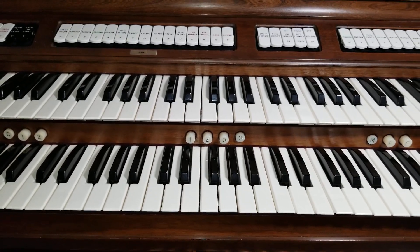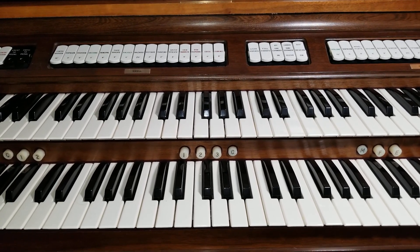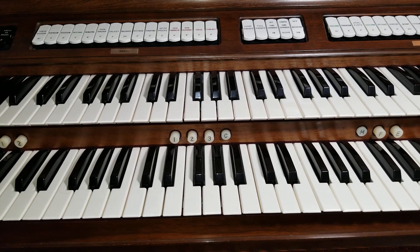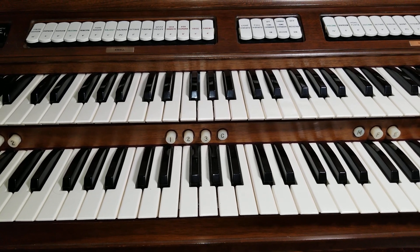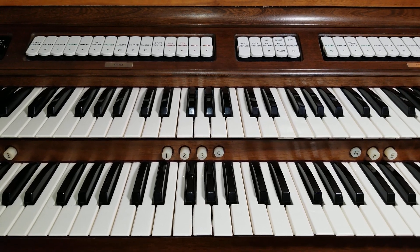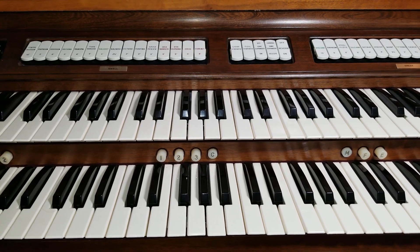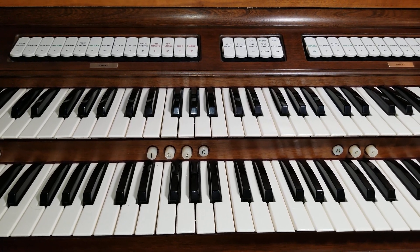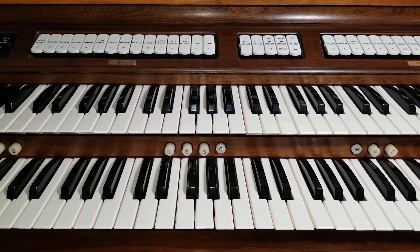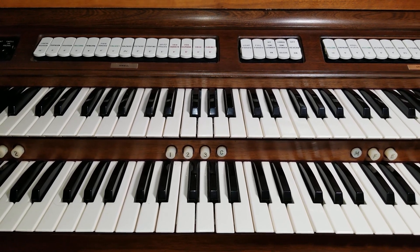One look at the back of this instrument scares a lot of people away. Each key actually has multiple switch contacts, because they're arranged by pitch, and they're not even direct switches — they use an elastomer technology, which I will be changing, because that won't work for MIDI. So it's quite an ordeal, but I am looking forward to it because I like electronics work. I'll be uploading videos detailing my progress and any interesting things I find inside. That's about it for now — thanks for watching.